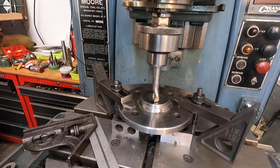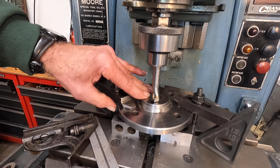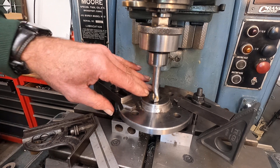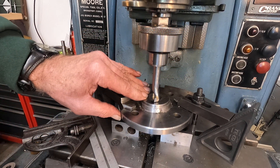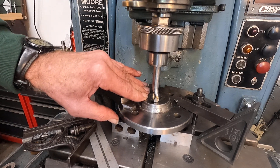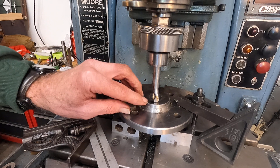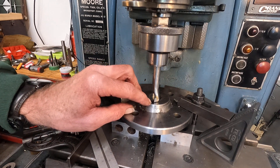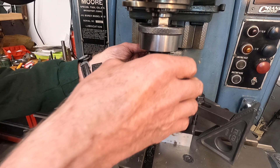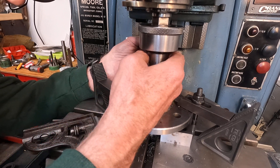We're back and we're going to shoot that hole one more time. On the first cut, we tested the material and found the speed — that little cut-out is somewhere around a thousand RPMs. I pulled the tool out and sharpened it, touched it up. Now I've got it back and I'm aligning it to the Y-axis dot, which gives me a consistent tool feed and tool angle.